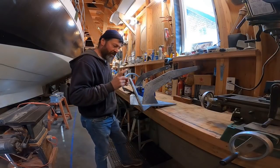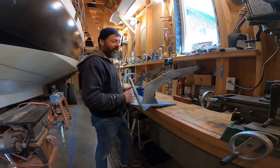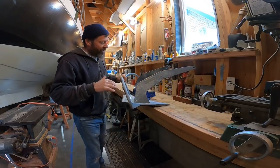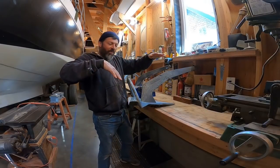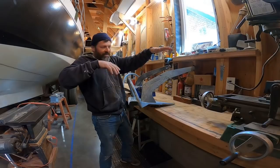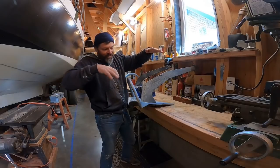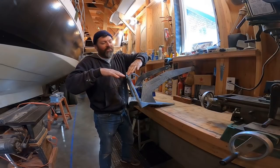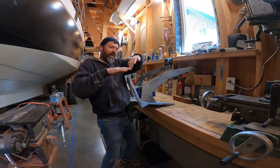Now, there's a potential for another seabed where you might want it to stop moving, and maybe my mods made it worse. And here's my theory. Say we've got a seabed that the anchor is diving down into, but at some point, no matter how much scope you have, chain will be laying up on the surface, and you can't pull it tight and straight. There'll be a curve to that chain. And the deeper the anchor goes, the steeper that part of the chain will be at the connecting point. The tendency will then be to tip the anchor farther upward.